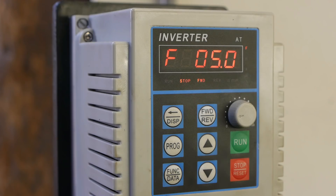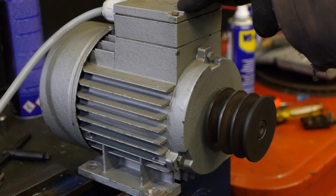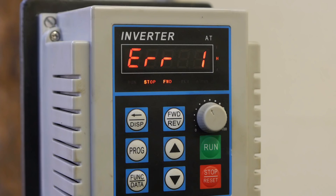That's 5 hertz. Now let's see the motor run. There's a lot of vibration — it feels like the motor is shaking a little. It gets better with speed. Then I got an R1 error. I've got the manual here and R1 is either a short circuit, a current overload, or power module protection. Let's reset the drive by cycling the power.